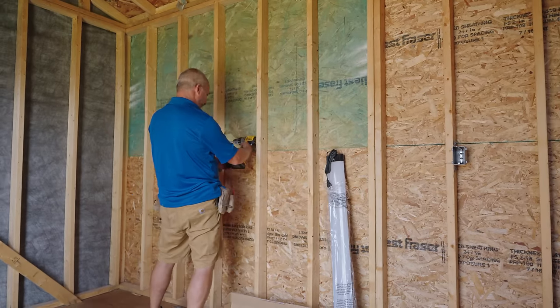So you're aware, there's brass screws. And then there are silver screws, okay? The way to remember it is the brass, B, goes with the black. So power in, okay? And then there's the ground screw, and then that's the neutral. So neutral here is coming from the panel. So what we're going to do first is identify the neutral, and we are going to get that onto the plug, okay?